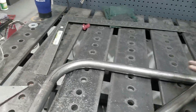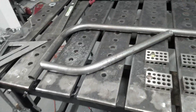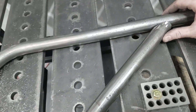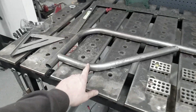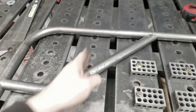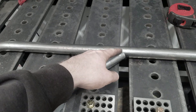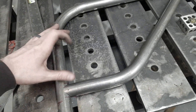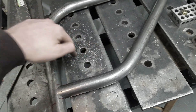So you saw me finish up those tubes — unfortunately the camera kicked off while I was bending them, but nothing too crazy: a 45-degree bend on one and a 90-degree on the other. I left about an inch and a half of overhang on this tube, and up here it fits pretty nice. This tube will be welded on after this tube is passed through the chassis. It'll butt against the passenger-side frame rail, and the driver-side frame rail is somewhere in this region. Then this bar comes up and connects to the tube — it's sort of an offset from center — and in this region you'll have a bracket that welds to the inside at 90 degrees with a bend down and out.